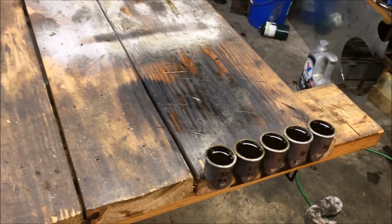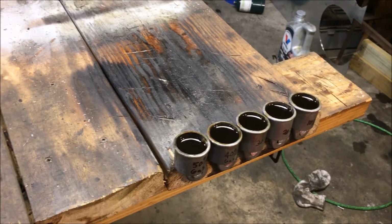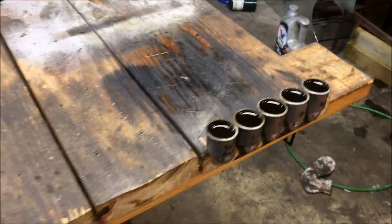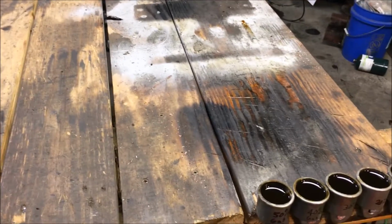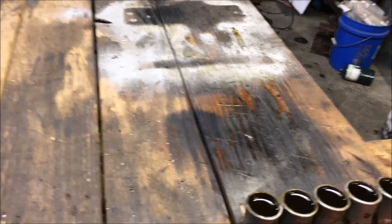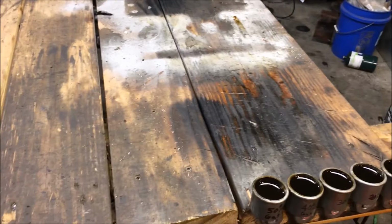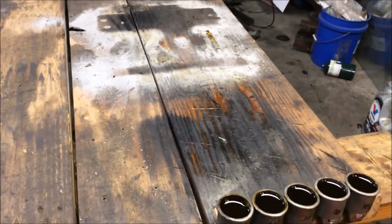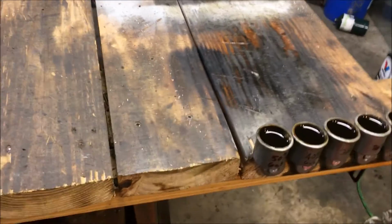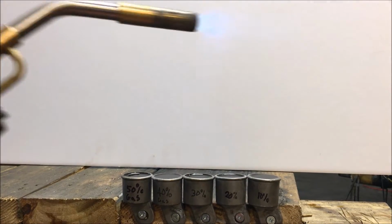So never touch off a waste oil burner with pure gas. I did it, and I'm here to tell you, it is loud. It is far louder than you would ever imagine. It was like an explosive, not your typical everyday gas explosion that you're accustomed to. It was ear-ringing and could have ruptured the vessel, but it didn't. Thank God. Okay, here we go.